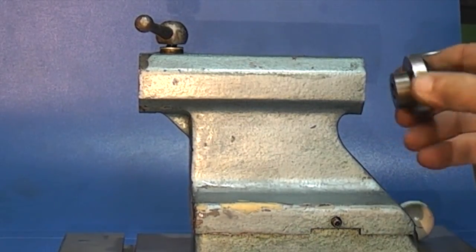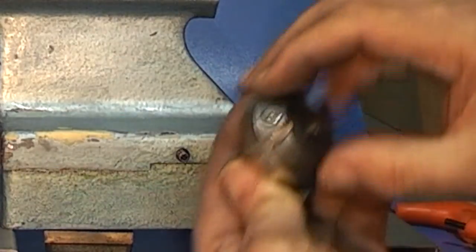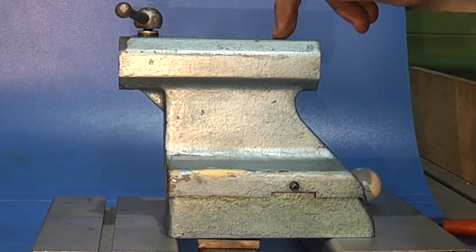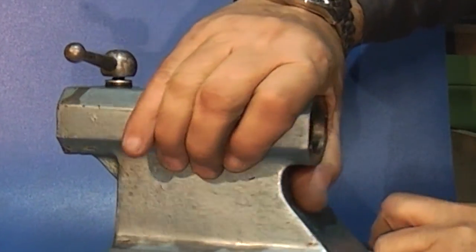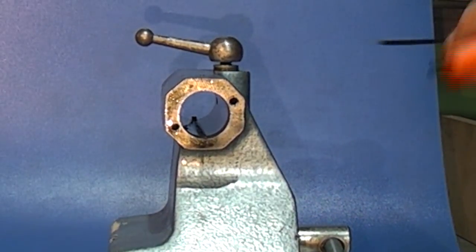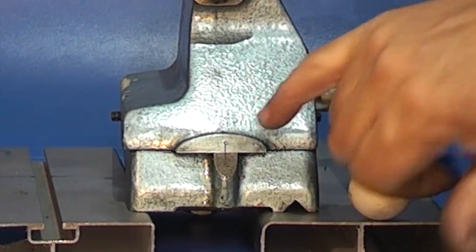This is the end cap off the end. I've added this alignment part so I can see what I'm reading when it's on there. It's got an oil nipple in the top that puts oil into this part just to lubricate the shaft. There's another oil nipple on the top which lubricates the thread and the quill. If I turn it around you can see the bore in there — there's a little peg. This is just the lock for the quill. Here are the zero positions for your tailstock offset — if you're turning a taper you can pull the tailstock over.